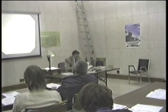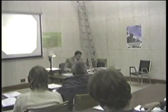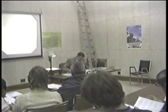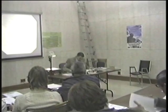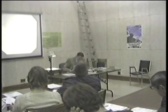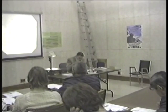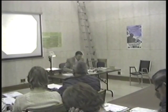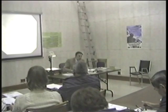Let's see, I think there's a section here that talks more about that. Page 57. It shows you what they call the up and down rings. And the up and down rings are moved up and down by a U-shaped set of dogs, or whatever you want to call it. And there's another supply reel lock solenoid that needs to be activated. Another source of perhaps looking for solenoid problems.